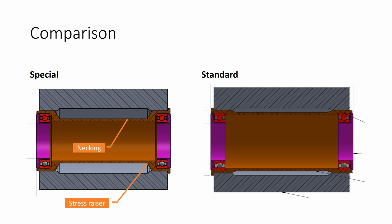To reduce that, I make the walls very, very thin, but I rely on something called second moment of area. What second moment of area is, is an object's resistance to bending or crushing stresses. Making it wider increases that value, the second moment of area, and again I'm going to show you on that board what that's all about. And then some of the subtle things associated with the mechanics of these things.